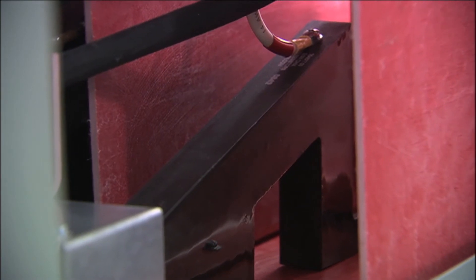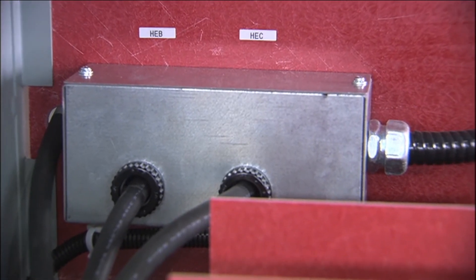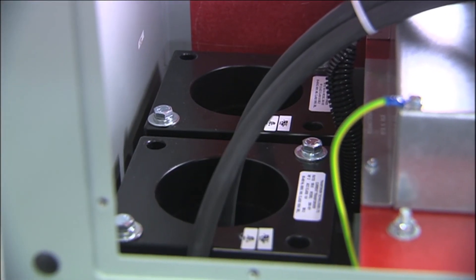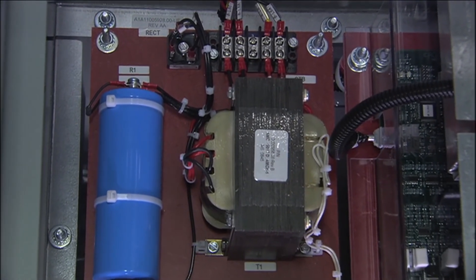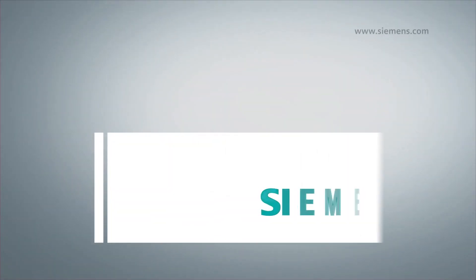The section also houses voltage attenuators, Hall effect transducers, a control power transformer, and current transformers. The power supply and control board that direct the patented cell bypass option can be mounted above the input and output connectors.